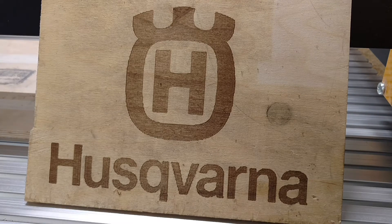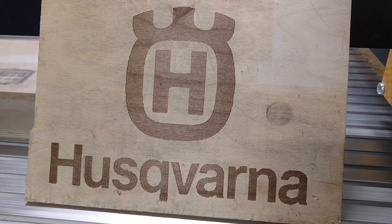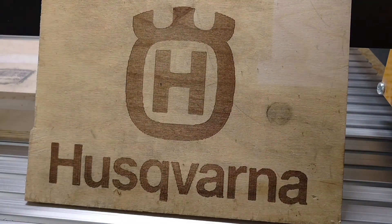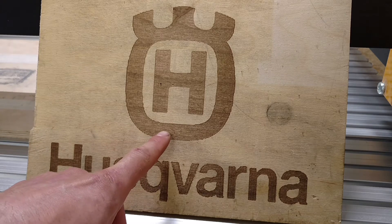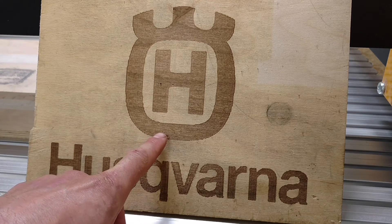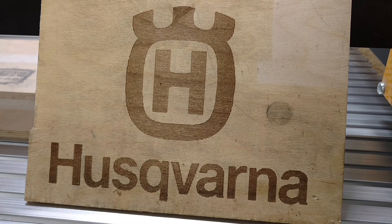This was pretty quick — overall it took about 25 minutes from start to finish, and honestly I think that's pretty fast. My step over on these lines was four lines per millimeter. You can go up or down by quite a bit — all the way down to one line per millimeter which is pretty low definition, or all the way up to 20 lines per millimeter which is a very fine step over.